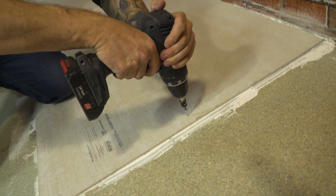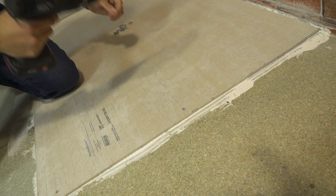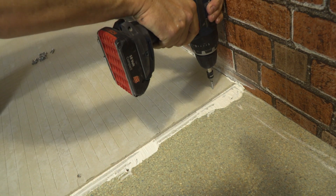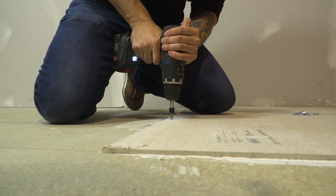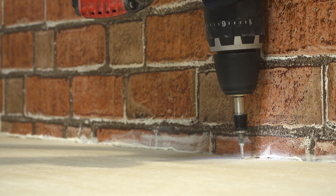As we're going along, you can see I'm using the indents at the top of the board — there are 39 markings on this board but now we only need 12. You must make sure that each screw is a minimum of 10 to 15 mil from the edge of the board.